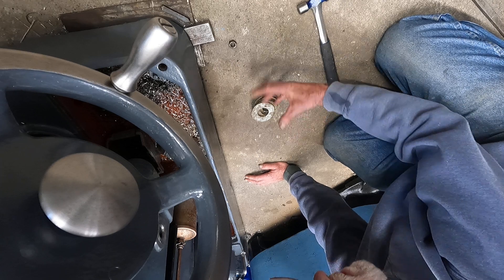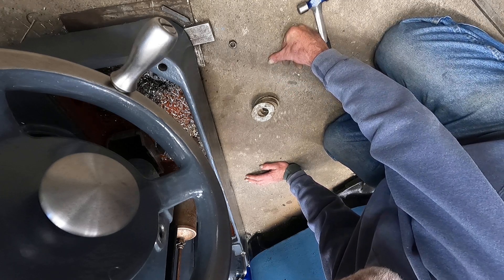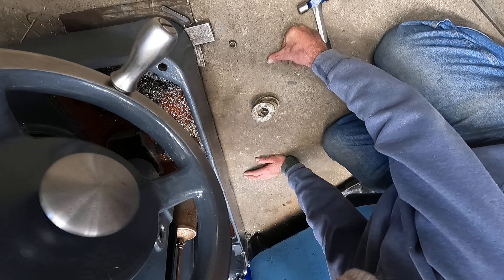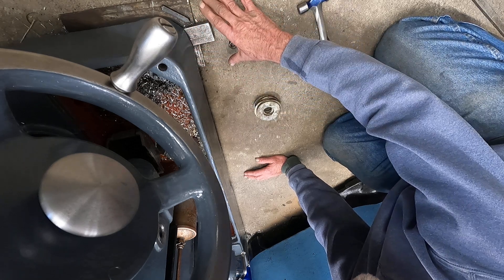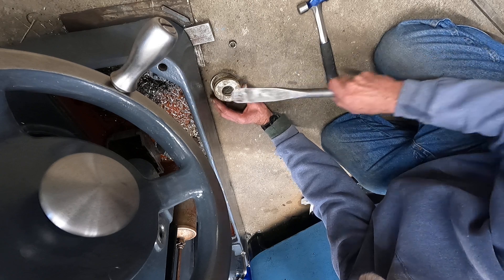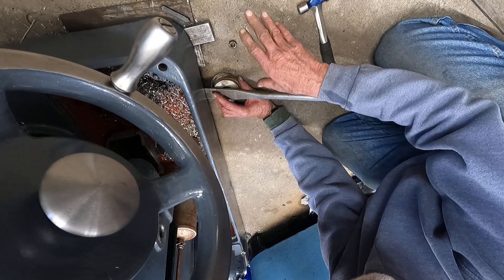A person came in and asked me how do you move this stuff around, how did you get this machine in here? I got it on a pallet jack, and you can get a mill like this through a 48-inch door — I guess they were designed sort of like that. I got it on a pallet jack, got it in here, stacked up plates on the corners, just high enough to get the pallet jack out. Then use these washers, prying it up on each corner and sliding the plates out. That's how I got the thing down on the ground.